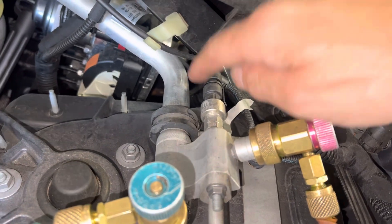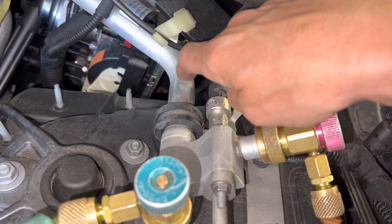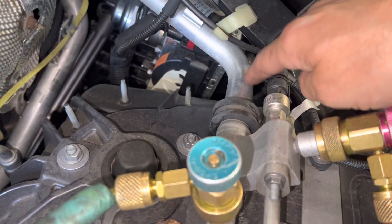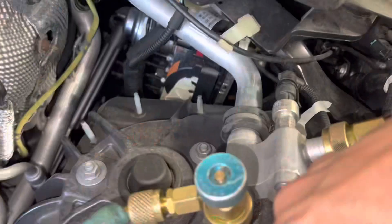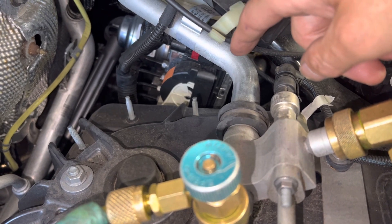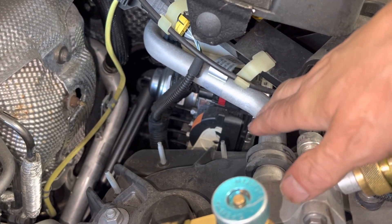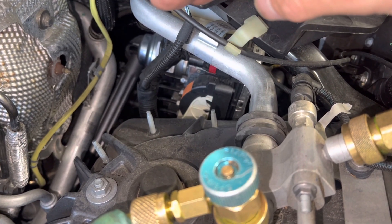You have a whole bunch of refrigerant paths with tubes and fins on the inside of this big pipe. There's another pipe — that's the suction line — right down here on the inside, and all the hot liquid refrigerant passes on the outside of the suction line, which is cold, transferring heat energy out of the liquid. So it has more BTU per pound available when it gets delivered to the expansion valve. This is their way of raising the efficiency of the system.